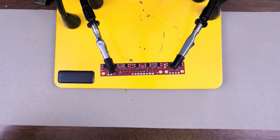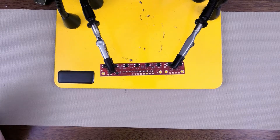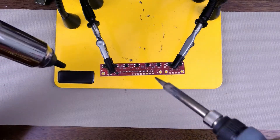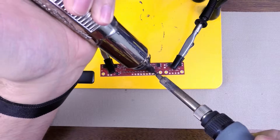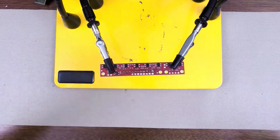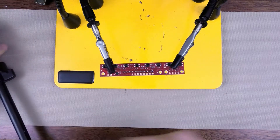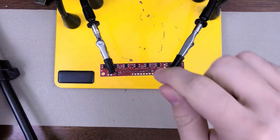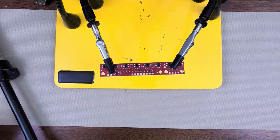And it's still going strong — I still use it every day. So, using a solder sucker, you would apply your iron and then just come in from the side and suck it up. Now, the problem here is that my solder sucker is not going to actually get all of the solder, so a little bit of solder remains on the back of that and the pin actually can't come off.